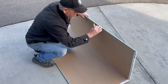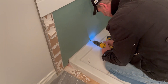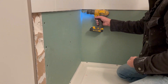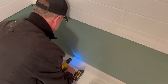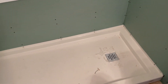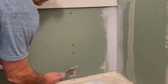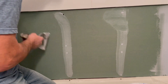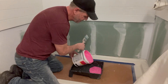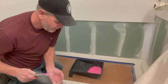Here I'm just cutting it all to fit and then screwing it onto the wall studs using inch-and-a-quarter drywall screws. From there I'll mud and tape all the seams to get as flat a surface as possible before applying a secondary layer of protection called RedGuard. RedGuard is a rubberized coating that you can roll on, and anytime I use it I always like to apply two coats. It dries really fast, so two coats usually only takes a few hours to get finished.